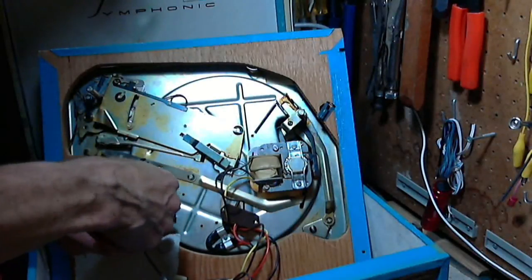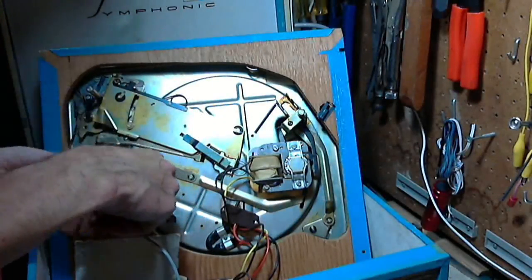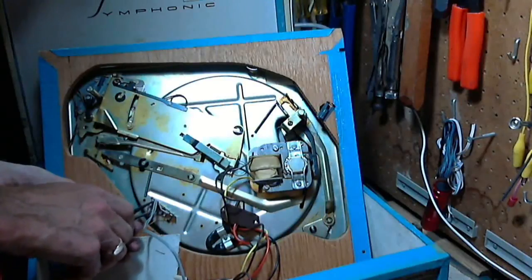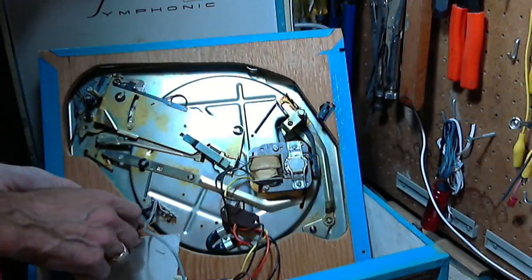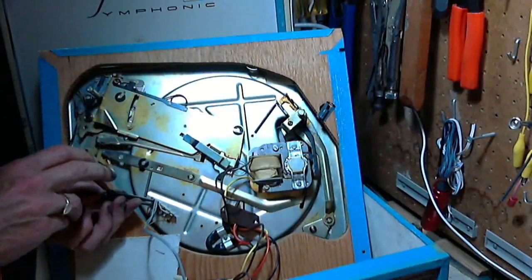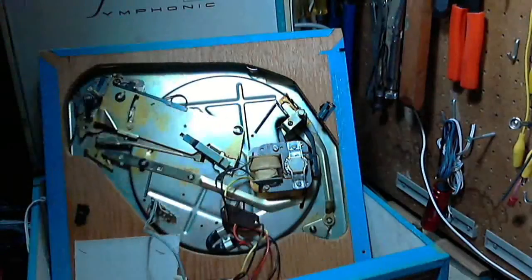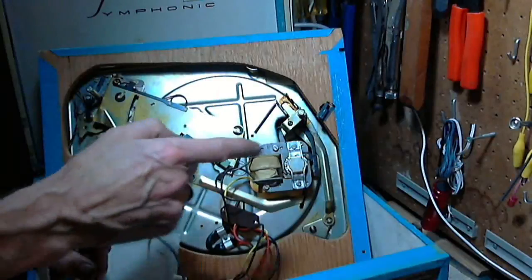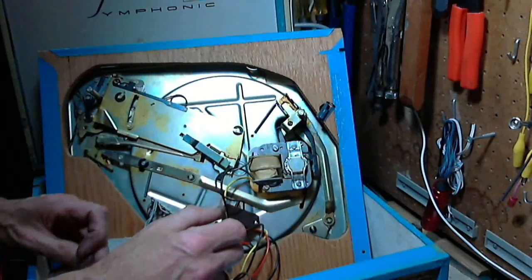Maybe I'll tell you what I did, since the videos I shot have no audio, so I can't really post them. I can't really post silent videos. That'll not be very good. So what I did, in the amplifier, I ended up replacing a three-section power capacitor. That's two sections for the power supply filtering, and one section is the cathode bypass capacitor. I put three new capacitors in. I changed the cathode resistor. It was supposed to be 82 according to the circuit diagram, measured at 95, but the color bands on it said it was 68. That's all kind of a mystery.